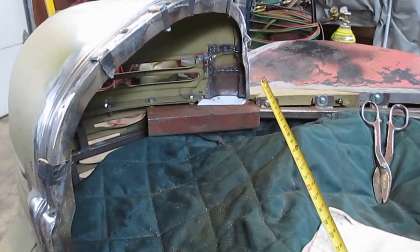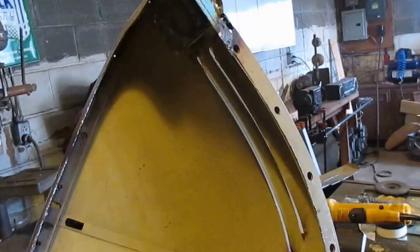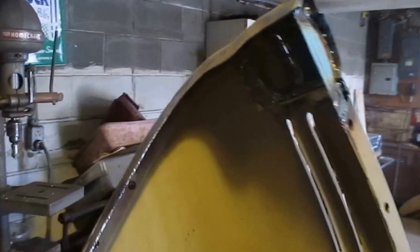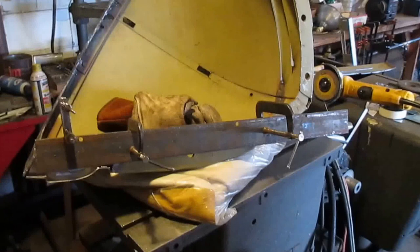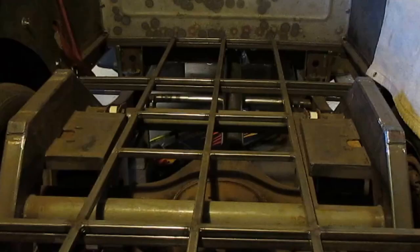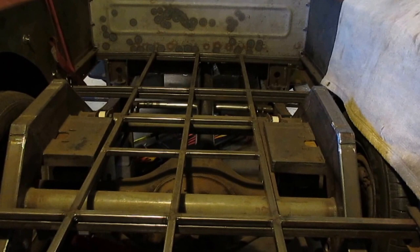What was nice is that the white piece of paper fit on both sides, so I know I'm fairly symmetrical. You can see that blue part right there that I added on — it connected the flange on the bottom of the nose to the flange on the side of the nose. Right here I put a piece of three-sixteenths saw plate that I had laying around and it gives me a nice flat surface so I can attach the one on the other side. I'm gonna get that welded on and that'll really stiffen it up.